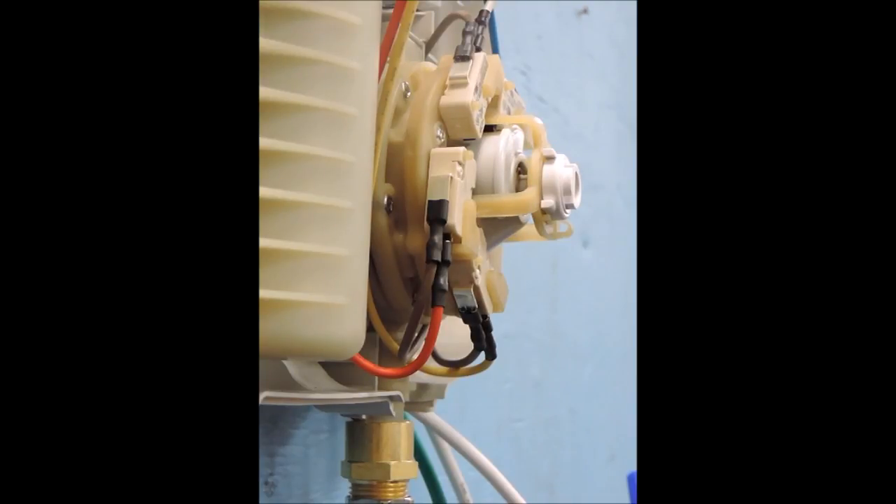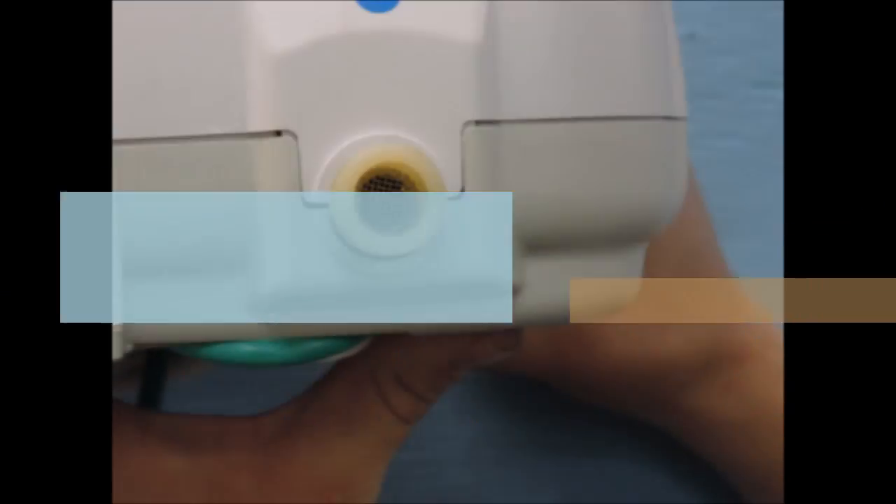Please consider not only the flow but also the water pressure — if it is too low, there may be issues with your setup. If your cone is not raising much or not at all, first check the water inlet screen located just inside the water inlet fitting. Be sure to close the ball valve before disconnecting the inlet.